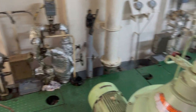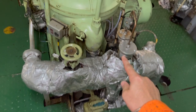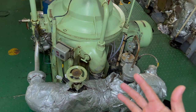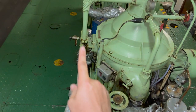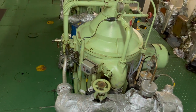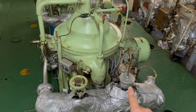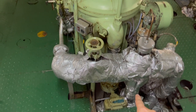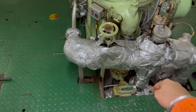If you look at the small cylindrical section between the two temperature control valves, that is the steam heater — the steam controller. The purifier oil comes from the steam controller through the silver lagging at the bottom, and on top there is a 3-way control valve through which the feed oil goes inside the purifier. The most important thing is the control air must be clean and dry.